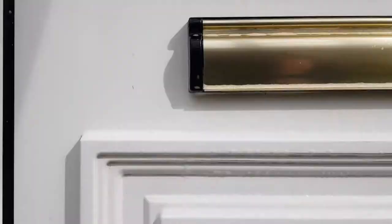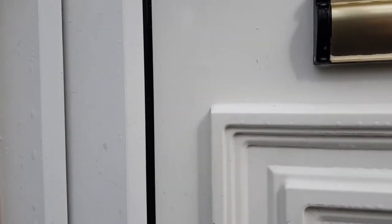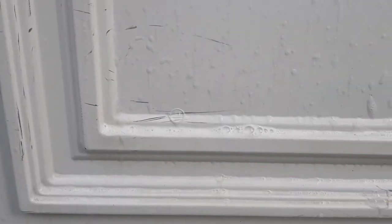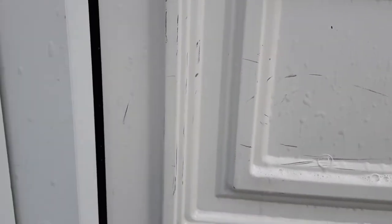Right, so this is just a normal PVC door - we've all seen these black scuffs. This is just a quick video to show how I get rid of them. I've already wet the door down with some pure water, but you can use any tap water, hot water, whatever you have. The chemical there is just a little degreaser - a Ubik or anything like that will do.